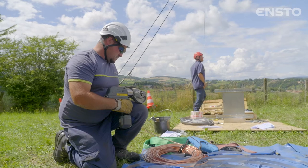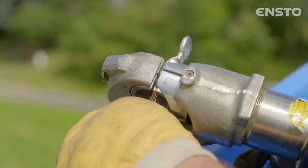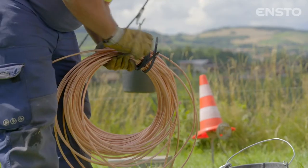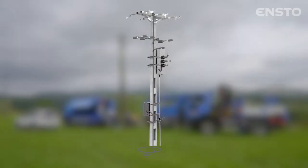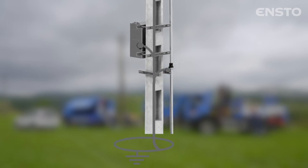All equipment must be connected to the earth for exposed conductive parts, with an earth value lower than 30 ohms, using minimum 25mm square copper braided cables. Earthing points identified by the earth symbol are provided. Crossarm supporting the network, on the lightning arrestor brackets, on the switch beneath the monitoring and control cabinet, with a diameter M12, on the manual backup control with a diameter M12.